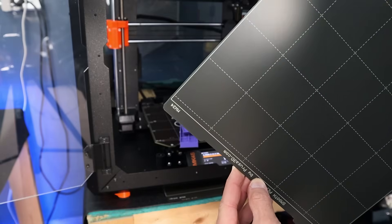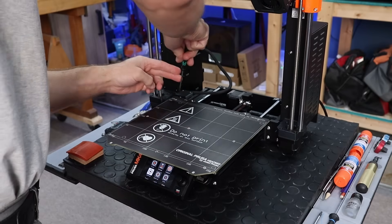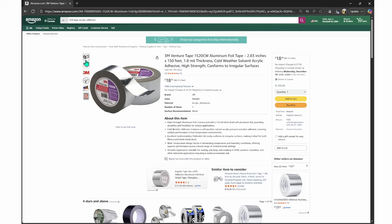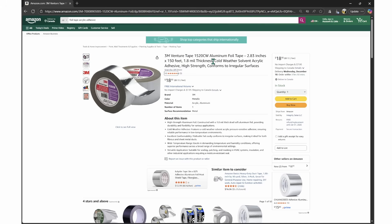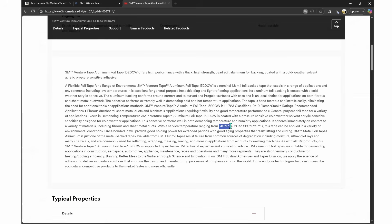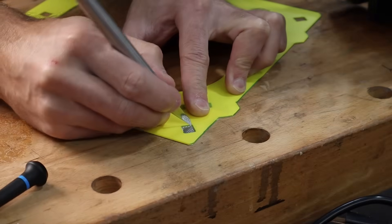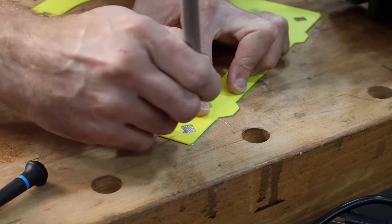If you want to move the thermistor, make sure you have a way to test it and be very careful not to lose the tiny screws — I lost one when it bounced away on the floor. I'll link everything used for the fix below. A quick caution: most tapes on Amazon say 'high temperature' but aren't — if they use rubber adhesive it won't handle high enough temps. I've linked ones with acrylic adhesive which can take higher temperatures continuously. 3M makes one called Venture Foil Tape which can exceed the maximum bed temperature of 120 degrees. The tape needs either acrylic or silicone adhesive. I'll also link the standoffs and the template for cutting the aluminum tape.